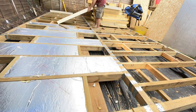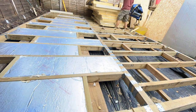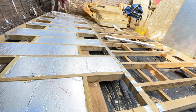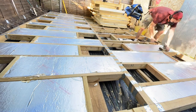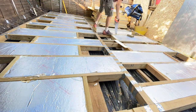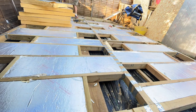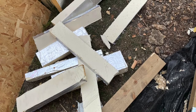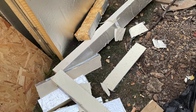The reason for doing this is you only need to make one cut on the insulation — just get your exact width and cut across the board. This saves a lot of time and reduces wastage massively. At £50 a sheet for the 90mm boards, you really need to be mindful of waste.